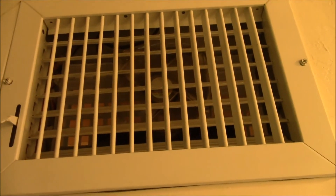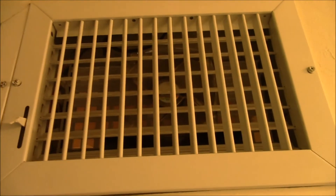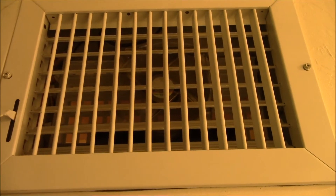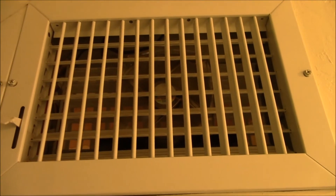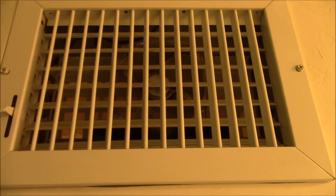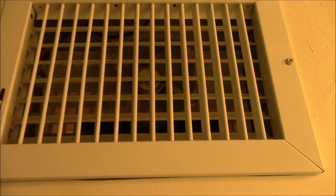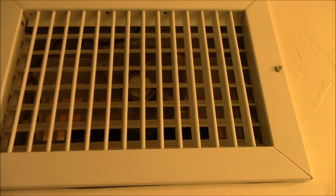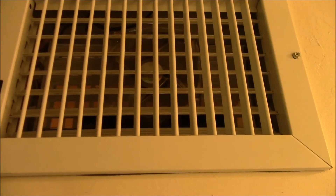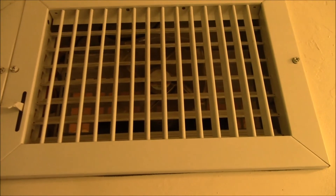The house still hasn't dropped below 60 Fahrenheit. It was 63 this morning and we'll probably finish the day over 70. Supposed to be another storm coming in, so we'll have to coast a few more days. This is the lowest sun angle in the winter, but I have my solar heat panels tipped up to about a 60 degree angle to pick up the maximum heat in the winter, and they seem to be doing a pretty good job, especially after I clean them.